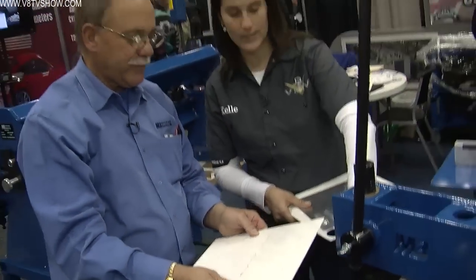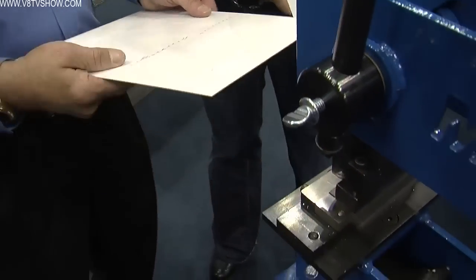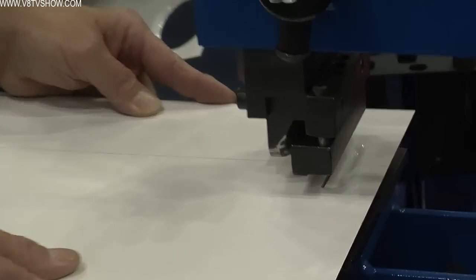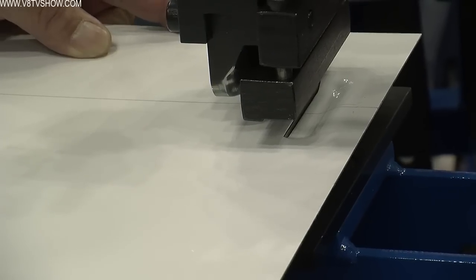We make different die widths from one inch to five inch. The beauty of this machine is it makes a nice smooth even cut, so no extra rework is required. The depth of the louver is set by the tooling — you can make it deeper, but there's a limit to how far you can stretch the material. If you stretch it too far, you'll start to stress crack it in the corner. For even spacing, after making the first louver you push it over the die and pull it toward you — that locks in the center-to-center spacing built right in.